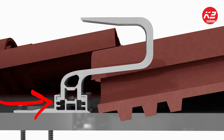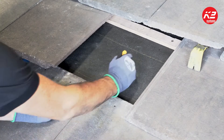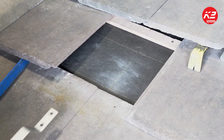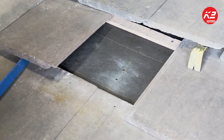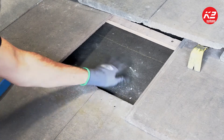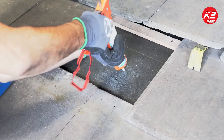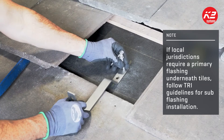If you're using the Tile Hook 3S, simply slide the top into your desired base level. Locate the rafter and, using the hook as a guide, mark your drill points and place the hook so it clears the tile drip edge. Using a 7/32 drill bit, drill pilot holes in the marked drill points. Fill the pilot holes with compatible roofing sealant, then with a 13 millimeter socket, install the provided lag screws.